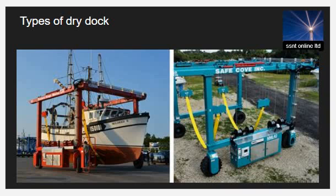However, if there is major retrofitting or massive parts or machine fitting is required, the graving dock is chosen as it is easy to move the material from land to dock as compared to the floating dock. And finally, the most critical factor in selecting the type of dry dock is the budget allotted to the vessel.